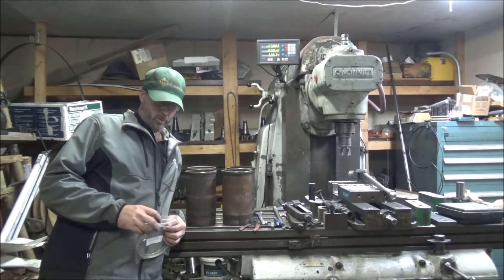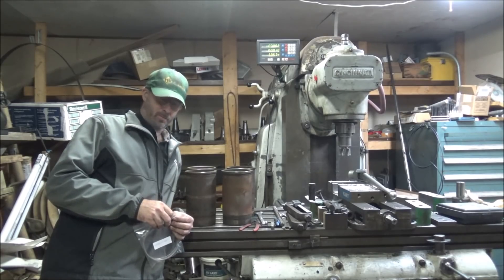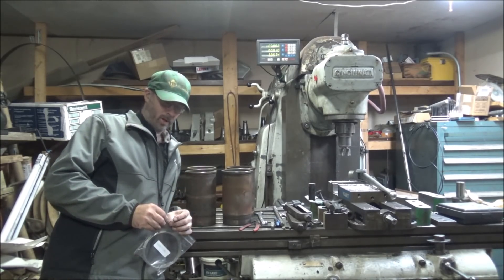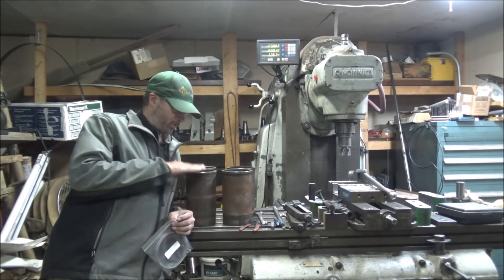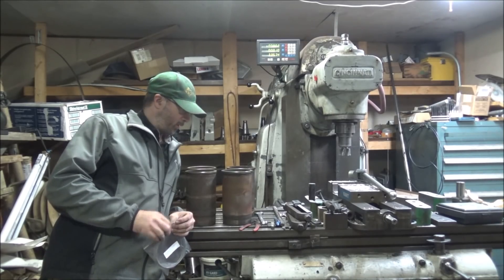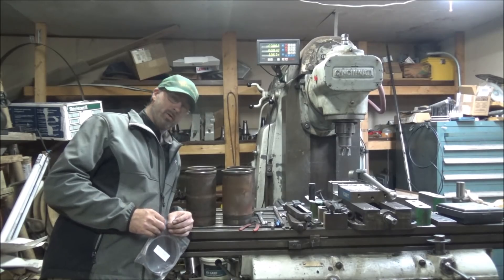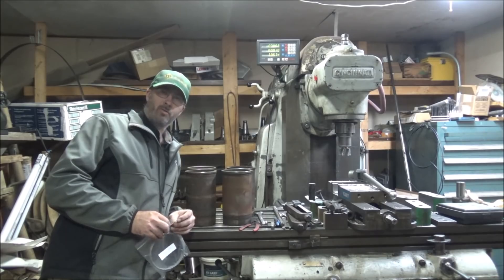I hope you enjoyed this quick little job. There's not a lot to doing these fire rings other than measuring the depth correctly and getting them cut. They're not super critical as far as center or anything like that, so being two or three thousandths off one way or another on the bore doesn't make any difference. The only thing that matters is the crush height - get that good and you're good to go. I got the other style liner cut down to match the rest, so these are ready to go back to the customer and they can put their engine together. Thanks for watching, thanks for subscribing, I'll catch y'all later.